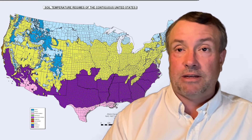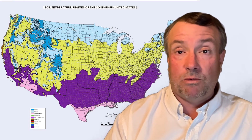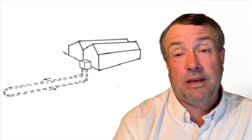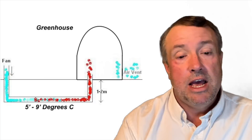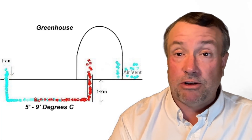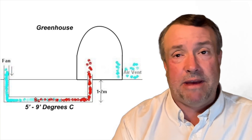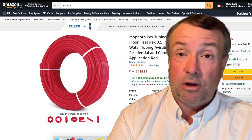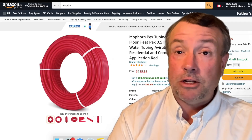We're going to talk about liquid delivery systems because I believe this type of transfer can avoid that problem with a couple of modifications. A low-grade geo-liquid heating and cooling system needs to be broken into two separate components. A lot of geo-air systems will heat and cool with the same tunnel, but it's much easier to run completely separate systems for cooling and heating. If you're in a location that needs geo-liquid heating, you may not even need cooling — you might get away with just venting. But if you have the excavator there, it's really not that expensive — a couple hundred dollars to add piping for a separate geo-liquid cooling system.